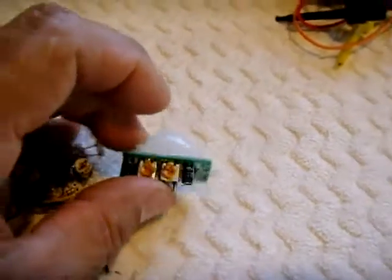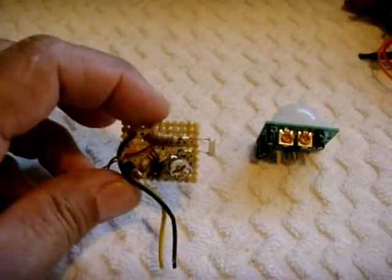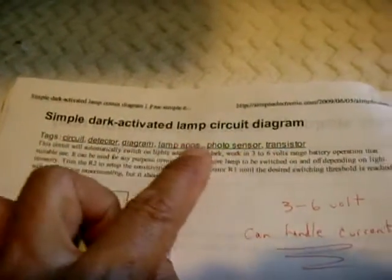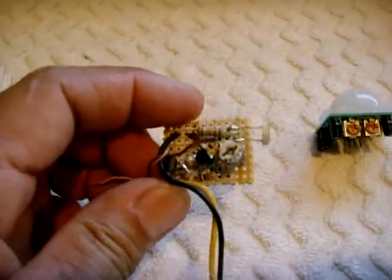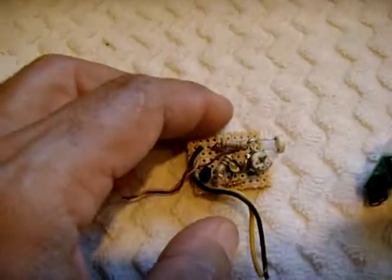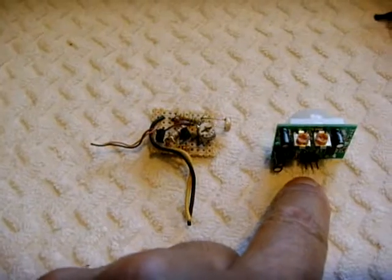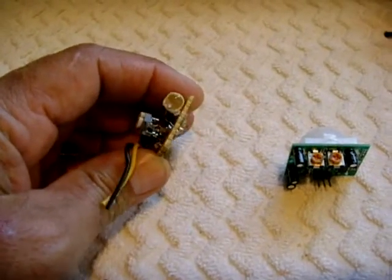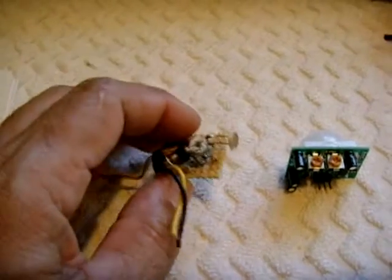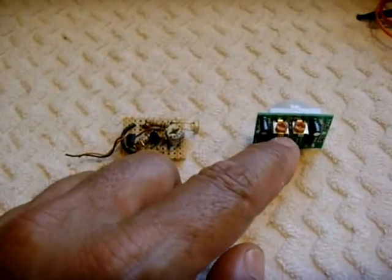What I'm going to do with it: I have one of these simple dark-activated lamp circuit diagrams right here. When it gets dark, I don't want this working all the time — I want it to activate at night when somebody walks in front of it. What this circuit does is supply power to the voltage pin of the infrared module only when it's dark out. You can see the photo cell right here — once the lighting is right and it gets dark, then and only then will power flow into this module.